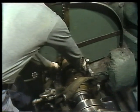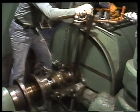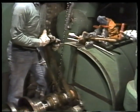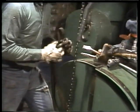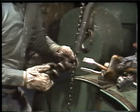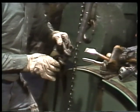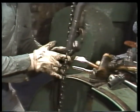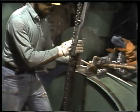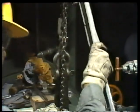For hoisting, use only nylon or another type of synthetic sling — using a chain or wire rope can score the shaft. Every piece of equipment, sling, shackle, and hoist has to be rated for at least the total weight of the load. Determine the shaft weight first; if there's any doubt, over-rig it. Using a safety latch on the hook is also a good idea. The shaft doesn't have to be lifted much — just enough to take the weight off the bearing. You'll be able to feel the tension on the sling once you've hoisted far enough.